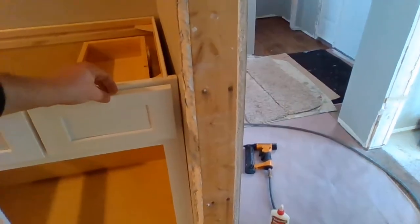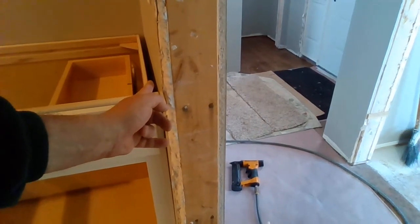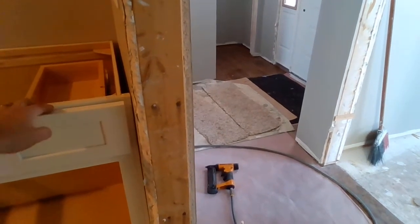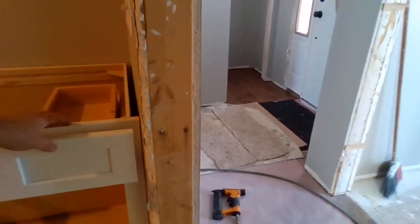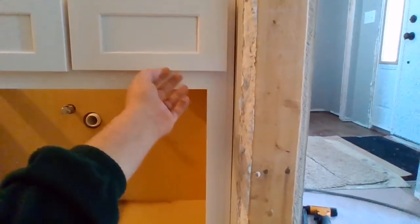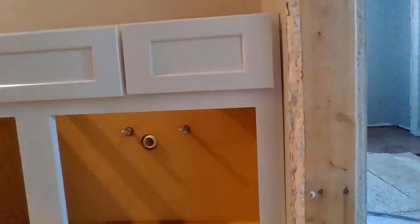Remember how I put this half inch in right here? So we have a little bit of a gap between here. Now there's a drawer in this cabinet — and there's a door going in right here also. The door casing is going to come out about five-eighths of an inch this way. Look at my drawer — I now have enough room for my drawer to clear what would be the door casing right here. If I had stuck that thing flat against the wall, this drawer never would have opened. I never would have got it back in there once I had the door casing on. So you have to think ahead a little bit when you're doing these things, just to make sure everything's going to open and close. We don't want door handles and drawer faces hitting door casings. That's another reason why we bring it out away from the wall just a little bit — but when I push it over, it'll be nice and tight. Let me get her all screwed in and show you what she looks like.